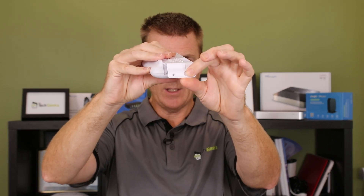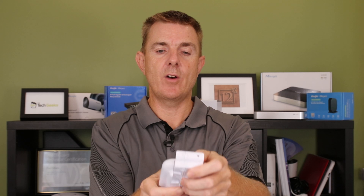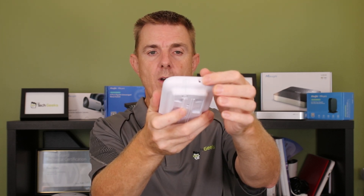So we've got quite a lot of mounting options. Once this clips back into place, if we have a look at the bottom we actually have an opening here that we can pass our Ethernet cable through. It's got a split, which I quite like — so we can feed through an already terminated Ethernet plug. Once that's clipped back into place, we put our retaining screw in to hold that. The unit is weathertight, so this can go outside — great for al fresco areas. It will also mesh with other Ubiquiti devices.